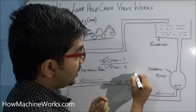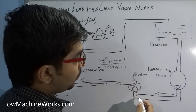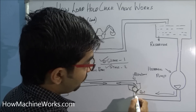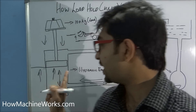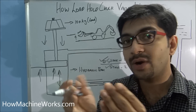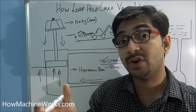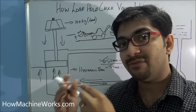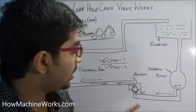When the pump creates enough pressure — say we have 200 bar pressure acting from the bucket towards the bottom — when we create 201 bar from the pump side, this lifts the ball up and the flow comes through in the correct direction, hits the hydraulic ram, and results in the hydraulic ram moving further upwards. So it holds the load and will not allow the hydraulic ram or the bucket to move downwards. That is why it is called a load hold check valve — it prevents the bucket from moving downwards when the second stage of operation is happening.